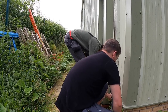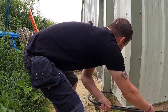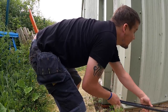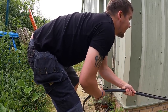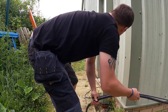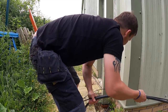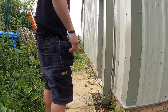No, that's good. Right, keep going. Right. Go. Just pull it to the end and then we'll feather it in after. Yeah. We'll get the hole drilled in a minute. Keep going, mate, because I can gauge how much we got left on the drum. Don't go in there though. Don't just pull a little bit of a loop, yeah. Yeah, that'll do. Right, we'll go in now and we'll drill that hole, mate.